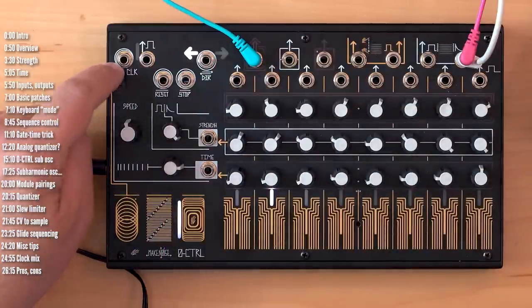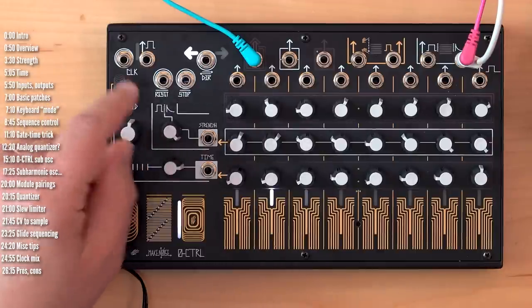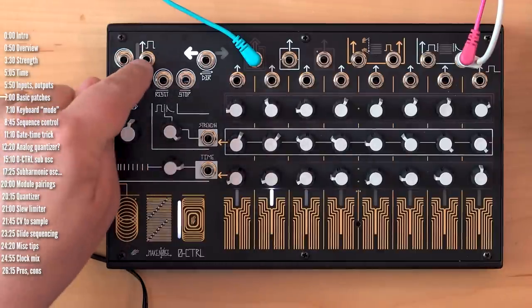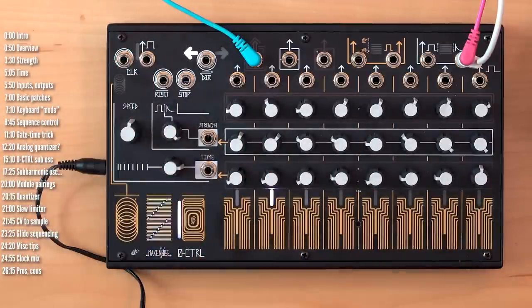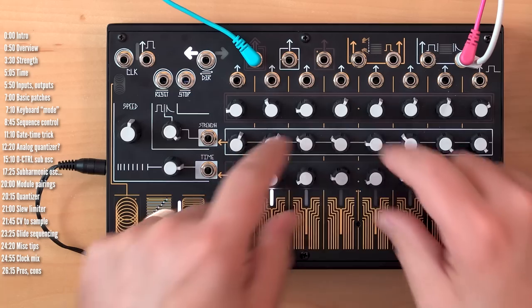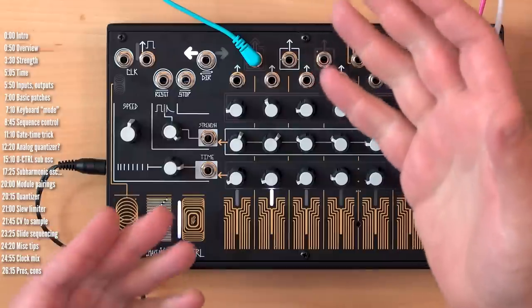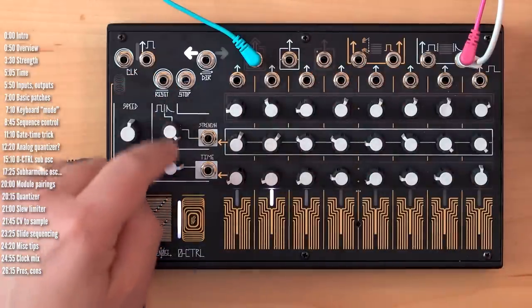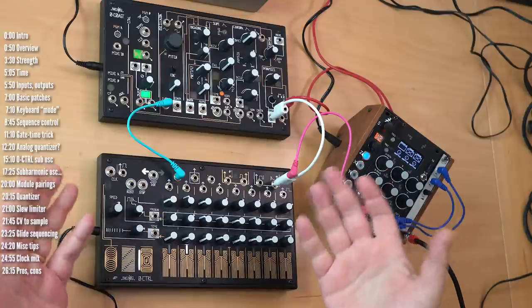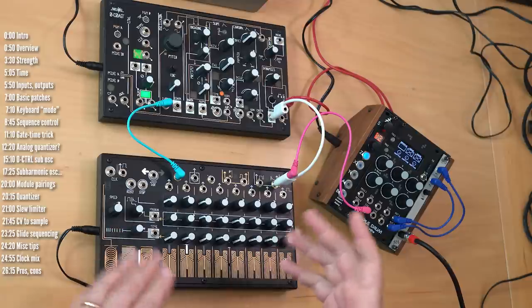This is the clock input, which gets mixed in with the clock that results out of speed, and the combined output comes out through here in a very interesting and rhythmic way. We'll take a listen to this later on. And then the strength and time inputs let you replace voltage coming in through these two rows with an external source, and then you can always attenuate that external source using these attenuators. So that's pretty much what each knob, output and input does. Now let's take a look at a few patch ideas and ways you can use it.